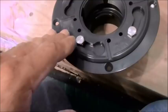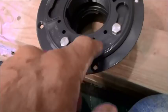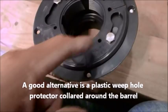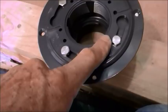If you put rocks in there, pebbles or whatever, and that pebble happens to be the same size or just slightly larger, and you're tapping down all your mortar mix, you're pushing a rock inside there, which is very dense. It's not as porous as sand is. So you could potentially clog your weep holes. Even if you use rubber spacers, you could have one flat sitting right there and not even know it. And a rubber spacer is definitely going to clog that weep hole.